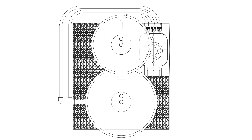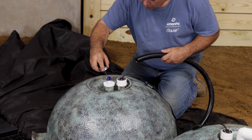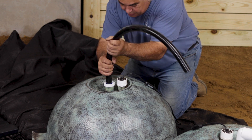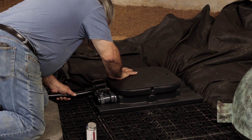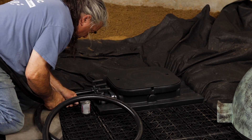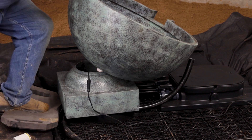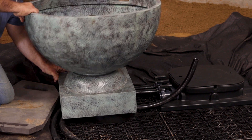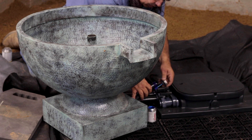Glue an inch and a half by one inch tubing. Depending on your particular layout, you may choose to route the one inch tubing around the outside of the reservoir or go right on top as we did. For this installation, we cut three roughly equal three-foot-long pieces of one inch tubing, then glued one of the three-foot pieces of one inch into the reducing bushing of the spillway bowl. Glue the other two pieces of one inch tubing into the eco-rise diverter on the pump vault to the outlets farthest from the bowls. Set the pedestal over the large eco-rise with the tubing slot in the eco-rise pointed generally towards the diverter on the pump vault. Then snake the one inch tubing and the light cord into the pedestal and set the spillway bowl on top — be careful of possible sharp edges on the pedestal. Adjust the position of the bowl and pedestal, then cut the one inch pipe as required to glue it into the third outlet of the diverter.